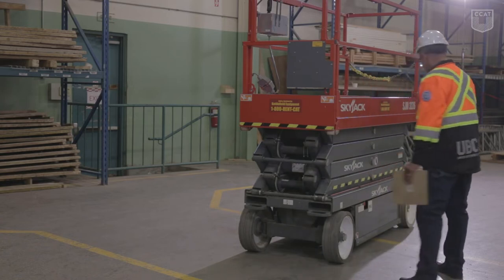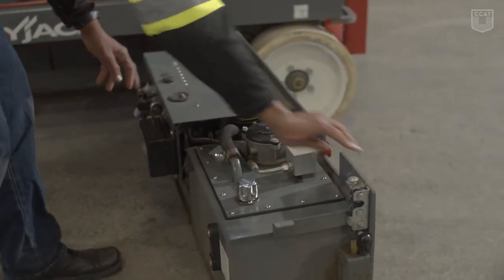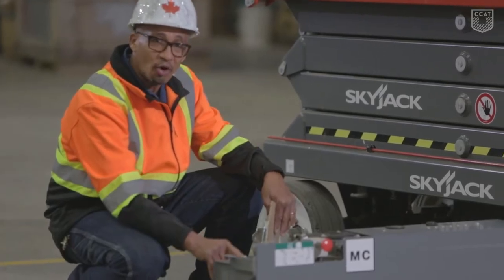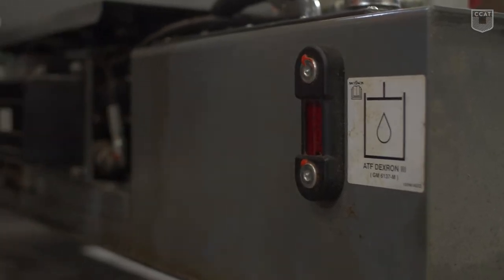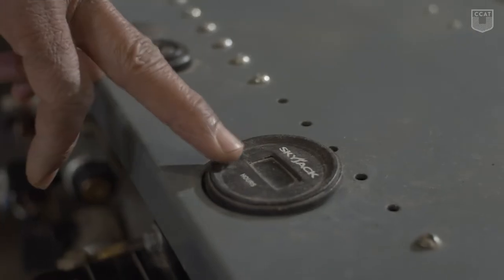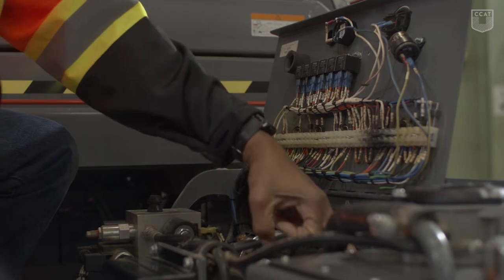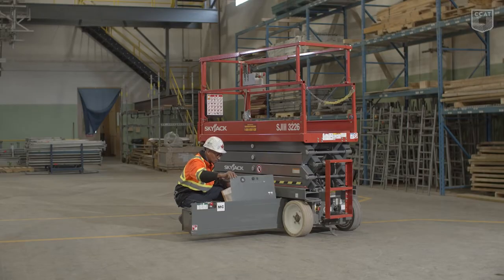This is called the hydraulic compartment of the machine — it controls the hydraulics. We check to see if there are any leaks and make sure that the hydraulic fluid level is where it needs to be. We're also checking to see that the fluid is nice and clear, not cloudy, not contaminated. Here is our meter reading glass. Once I lift up this electrical panel, I'm looking at the motor, the pump, and other pieces of equipment where there are likely going to be leaks.